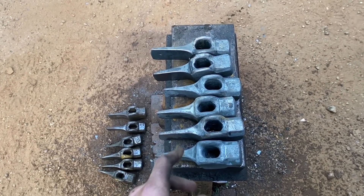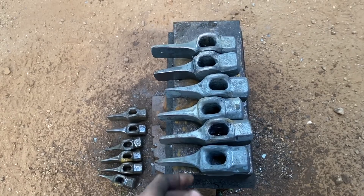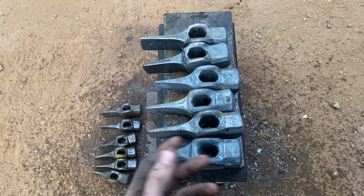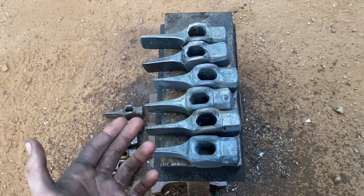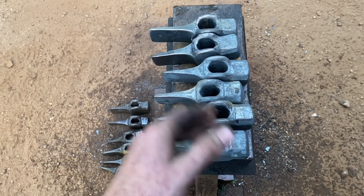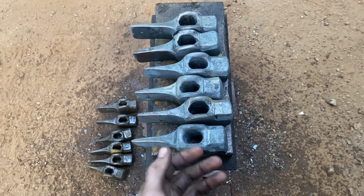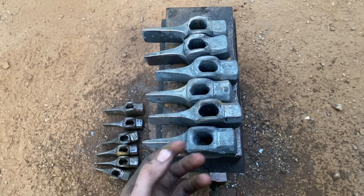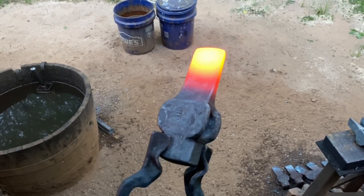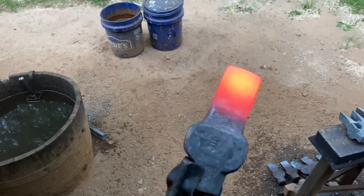Alrighty, got these babies nice and ready for heat treat. H13 is an air hardening steel, so the heat treat's pretty simple. What I found through trial and error is that if you just heat the whole piece up and let it cool on its own, the cheeks and the struck end hold so much heat that they cause the whole piece to cool down relatively slowly. And to harden steel, you cool it as fast as possible — that's more or less how it works. So usually what I'll do is let these guys get nice and cool to the touch after the thermal cycling and wire wheeling, and then take a nice cherry red heat just on the working end. This end being comparatively cold will suck the heat out of that quick enough to get us a good hard, strong edge. It looks a lot hotter on camera than it actually is — it looks like a dull red in person. So we'll just set that guy to the side to cool and that's that.